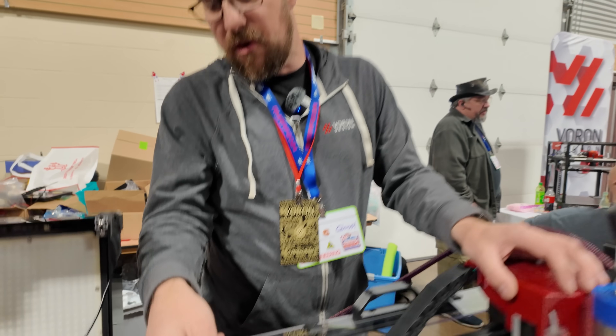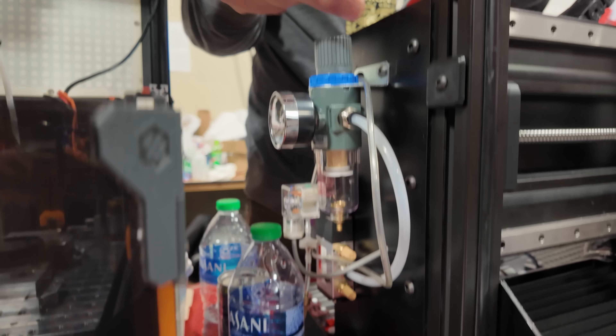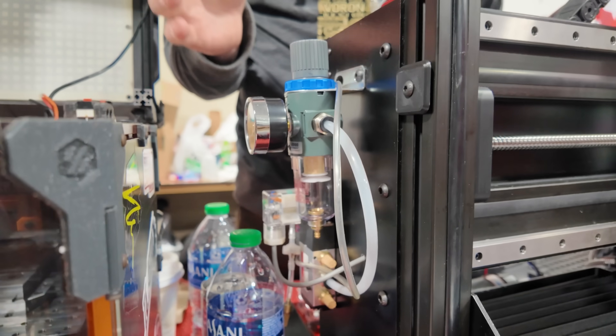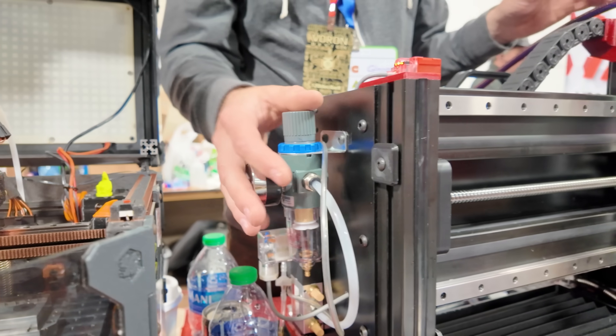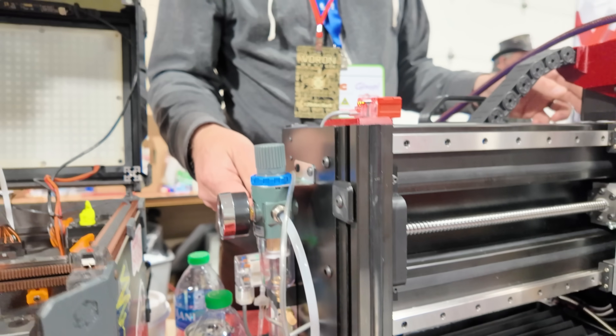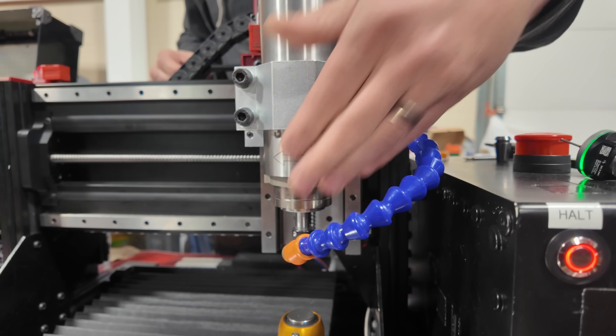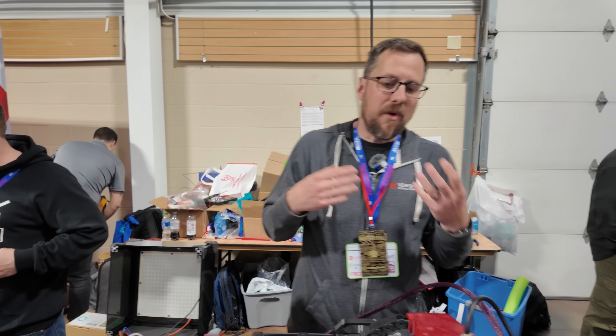The side panels and back panels are aluminum — that's to help with rigidity and keep as much torsion resistance as possible in this compact package. There's also an optional air or mist system: you take shop air in through the back via a regulator, a solenoid controls it, and it delivers compressed air or mist to the cutting area. When cutting aluminum, the air blast really helps with getting chips out of the way to avoid chip recutting, which impacts cutting performance.